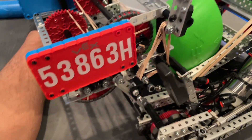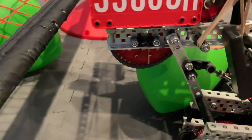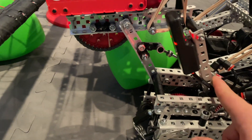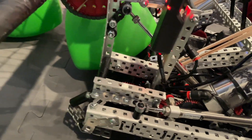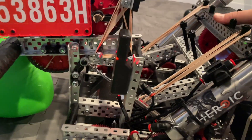Probably the coolest feature of my robot: a lot of teams I've seen actually have to manually retract using their pistons to deploy when they run into the goal to score. So let's say we have a tri-ball sitting here. Rather than completely retracting our intake, we can have the tri-ball just sit here. We have this really awesome joint feature — I highly recommend copying — it's similar to the 4-bar deployment design, connected to the piston. Rather than fully retracting, we run in, the piston goes up, and we can simply just spit it out. It works amazing, and it just comes back down. That's our intake.